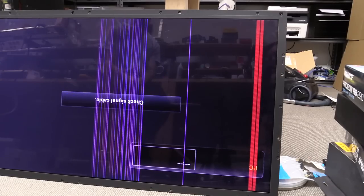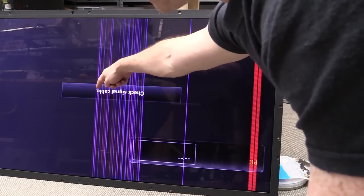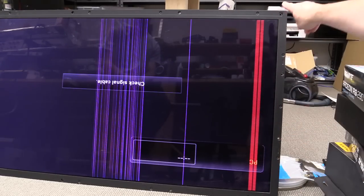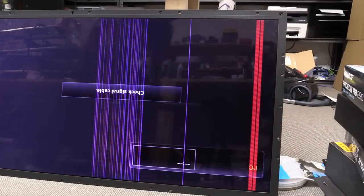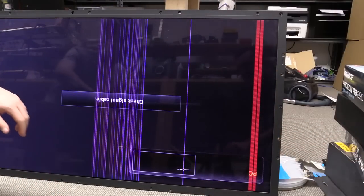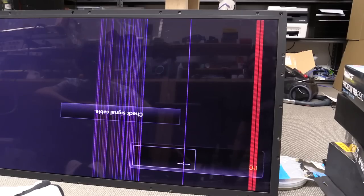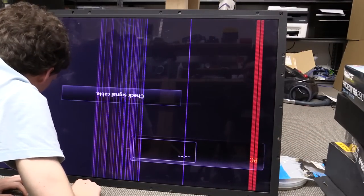The other thing we're perplexed about is why it only seems to be — well, the vertical issues here only seem to be on things which line up with ASCII characters. You see we've got our characters here and the vertical lines are each lining up with each ASCII character. The PC over here is like orange but we're getting red stripes lining up with the ASCII characters, and this one lines up with our colon there — but there is an extremely faint one trailing in the outer pixels of those two characters.